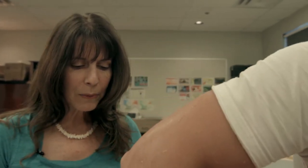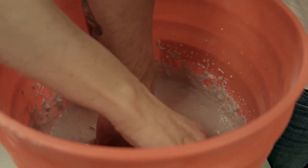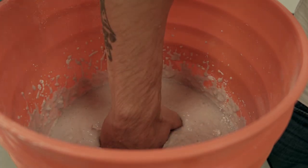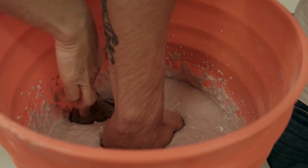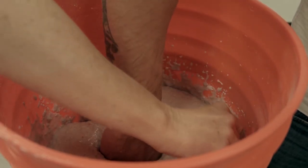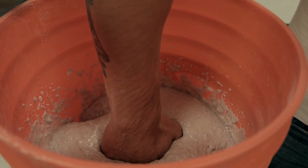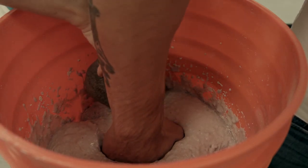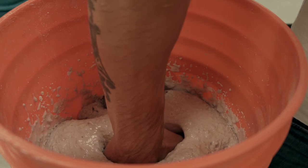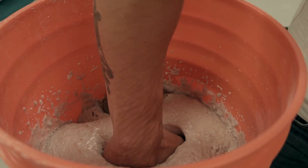Just go straight in. Don't go all the way down to the bottom because then you'll wind up with flat fingers. He's just going to stand there for about ten minutes. What I'm doing now is adding things around his hand to displace the liquid and take it further up. I'm just going to lift up his arm so that we get a little bit more of his hand. I'm using the displacement so that we get more of his hand. Now we just wait about ten minutes for it to cure.